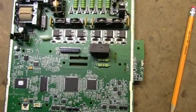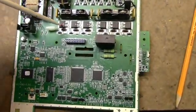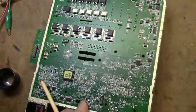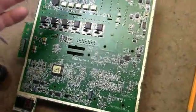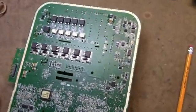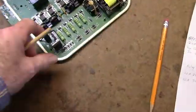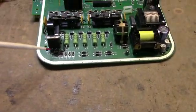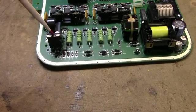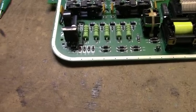This board does have some useful components on it. These components here are SCRs — they're 16 amp, 1,000 volt SCRs, and there are 17 of them on this thing. On the back it's also got some 4N35 opto-isolators; I've got tons of those, so they're not really worth salvaging. But what's interesting right here are two IGBTs — insulated gate bipolar transistors — rated at 1,200 volts at 24 amps. Those will be useful for something.